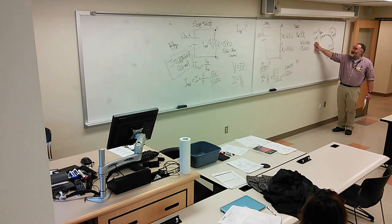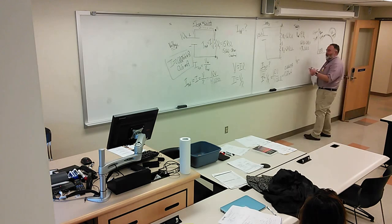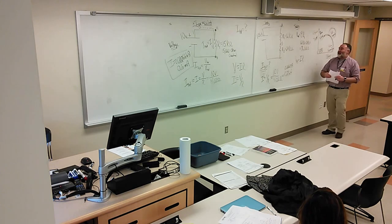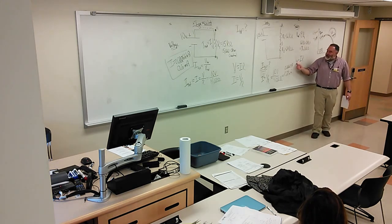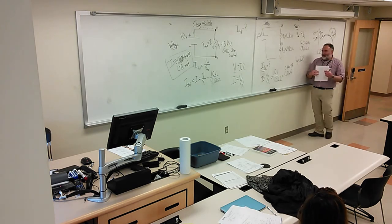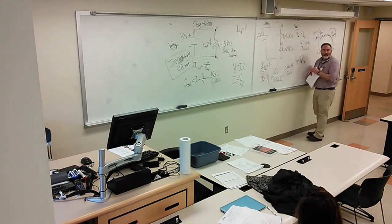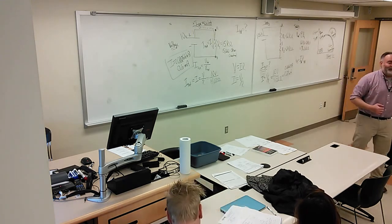Which tool do we use? We want to find the voltage from A to B. Do we have a tool that says V equals something? Yeah. What is that tool? We love V equals IR, right? Now, wait a minute. I can't mix metaphors. What's different about this? This guy has the voltage A to B. So what do these guys have to be? They better be the current A to B and the resistance between A and B. I'm like inventing new stuff. I never saw that equation before. I just invented it, okay?